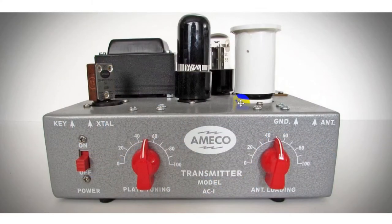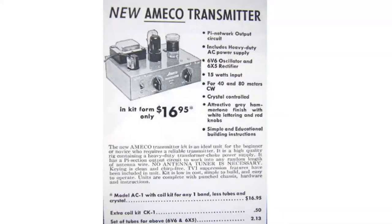Let's look at a few charts. This is the radio we're talking about. It was a very common and popular radio back in the 1950s, designed specifically for novices. It's crystal controlled — you can see the crystal sitting right here. Just two tubes. This is the coil form where you pick a band and build a coil for it, basically 80 and 40 meters. And this is where you connected the antenna.